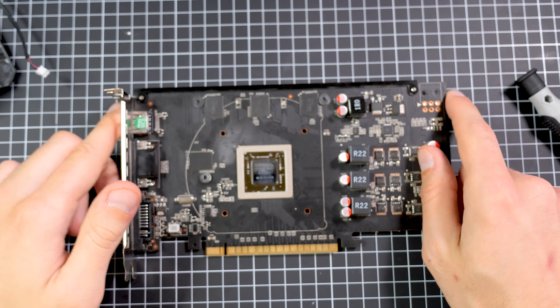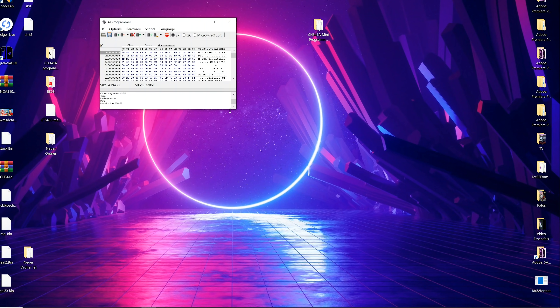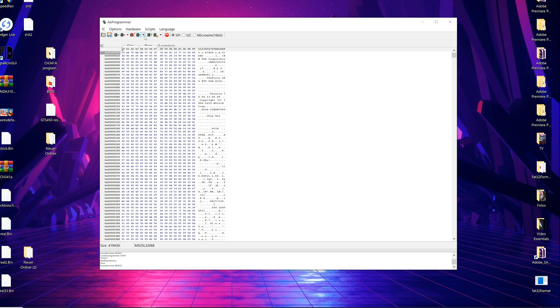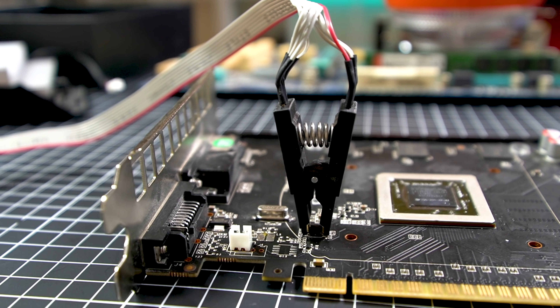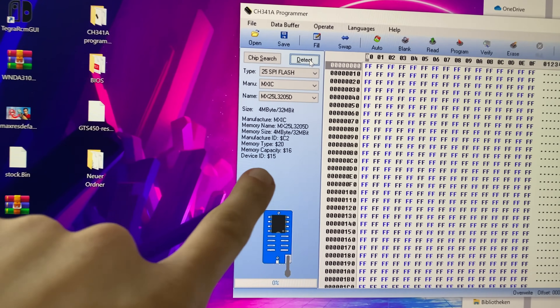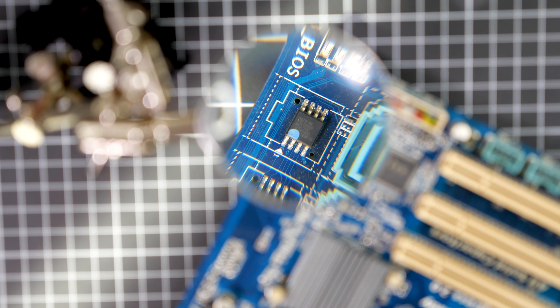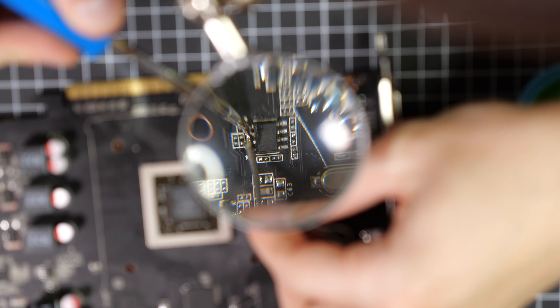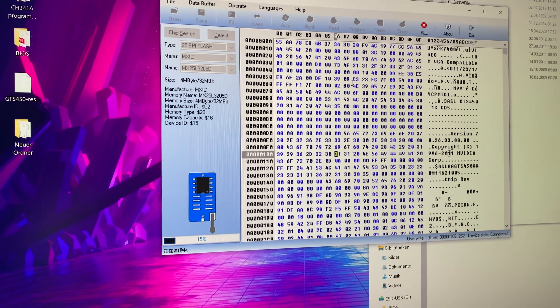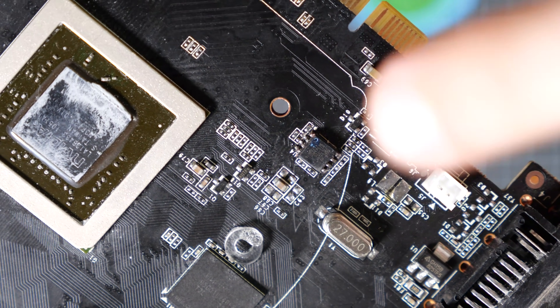Now I've shown you the hardware part. Here's the software part: how to extract, save, and rewrite the BIOS on your graphics card. Usually the process is simple — download the flasher software, install the drivers, identify the chip model of your graphics card, download the BIOS from a few cards, connect the clip and save the stock BIOS a few times before you start to flash anything. Unfortunately it looked like my BIOS chip is broken, as the readings were all garbage. I tested the clip for a couple of hours, but the clip is fine because I could read the chip from an old motherboard without a problem. So I decided to desolder the BIOS chip from the motherboard and exchange it with the one on the GPU. Before I did that, I flashed the BIOS of the GPU to the motherboard BIOS chip and checked if everything is fine — and yes, it worked without a problem.